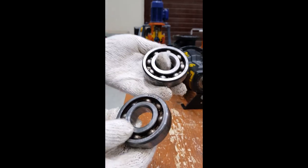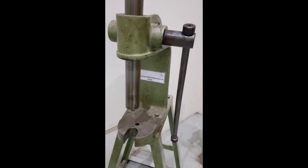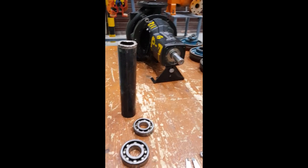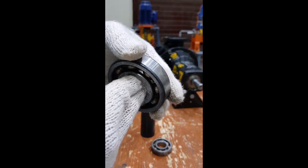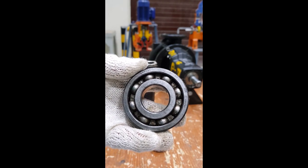The three methods for installing bearings on a shaft are: first, using an extension and hammer to press the inner race onto the shaft; second, using a press fit — manual, hydraulic, pneumatic, or rack-and-pinion; and third, shrink fit, where you heat the bearing until it expands slightly, insert it onto the shaft, and allow it to cool to room temperature or use other cooling methods so the material shrinks and the bearing is secured in the correct position.